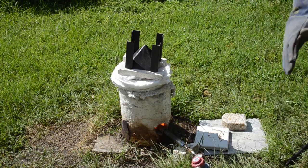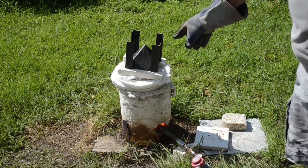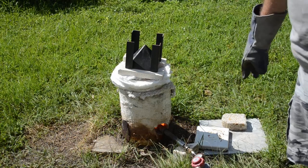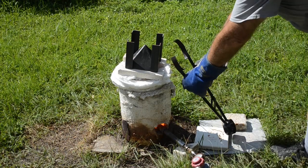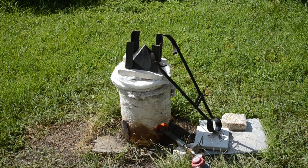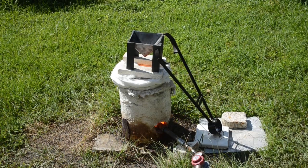I'm hoping that when I pour, because the viscosity is so low, all the lead will wind up at the bottom of the pyramidal cone mold and contain all the metal that was in that sample — all the gold, all the copper, any silver. We're getting really close to being ready to pour. I'm going to preheat the cone mold — very important — not just to drive out any moisture, I want to get it really hot so that the liquid slag will stay molten a little while longer and allow everything to consolidate. I'll get the tongs warm too — don't want any moisture on the tongs, moist tongs might crack the crucible.